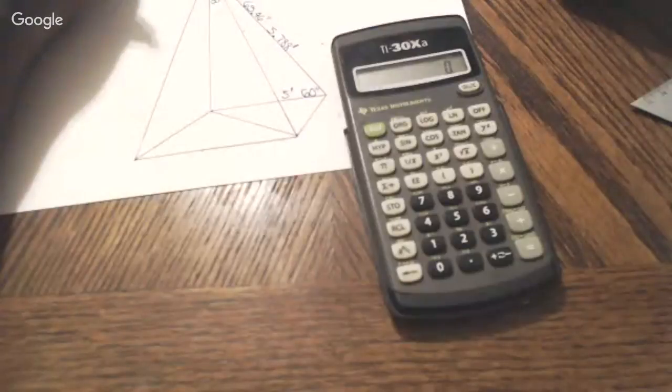All right. Now, we already know the other side is 11/12, and this is a 7/12. The other thing you got to establish before you get any further is how long your overhang is going to be. Is it going to be 8 inches, 4 inches, 3 inches, 3.5 inches, 3 3/4, 3 3/8? Is it going to be 12 inches, 2 feet, 10 feet? What is the overhang going to be? This is very important before you go any further. And when you're dealing with a mixed pitch, you got to know what your overhang is going to be.